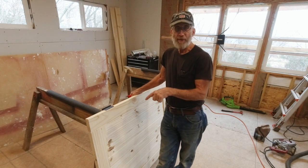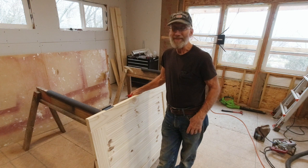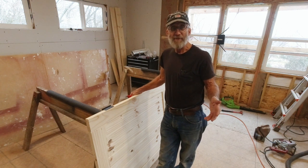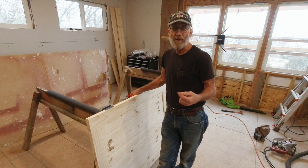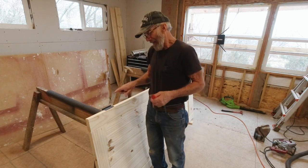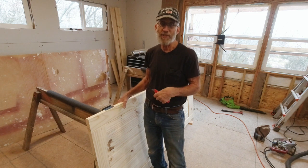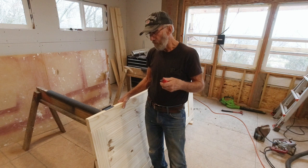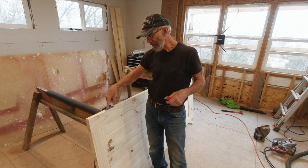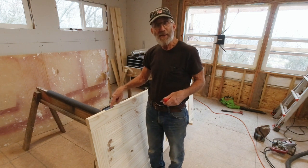I am ready to start doing the hand mortising for the hinges. A lot of people would say there's a more modern way of doing this, and they're right — I've got a router and a hinge template back in Colorado, but even if it were here, for just a few doors I'd much rather mortise by hand with a hammer and chisel. I do like using square butt hinges instead of ones with rounded edges, since most mortising is done with a router now. What I do is pre-set the hinge in its location, screw it in place with a couple of screws, and then use that as my template for the mortising.